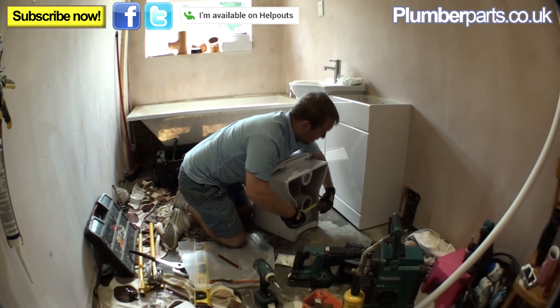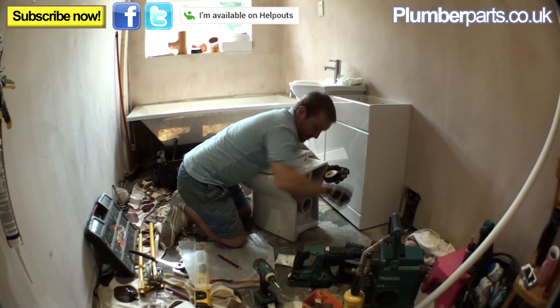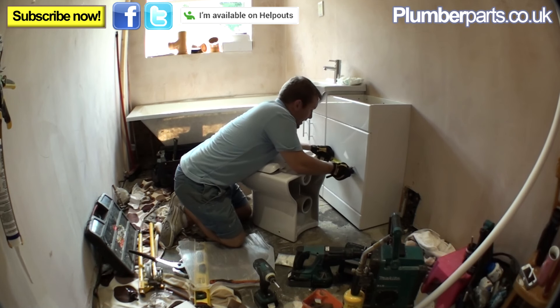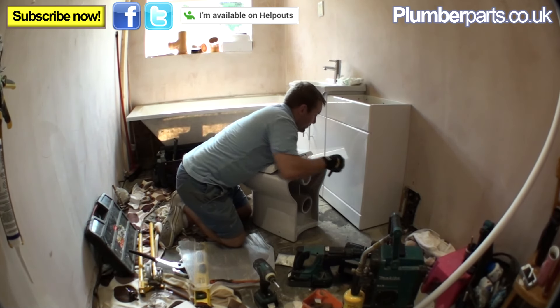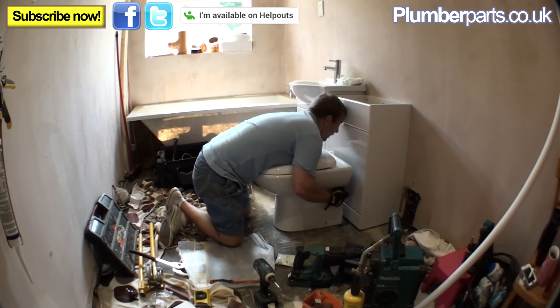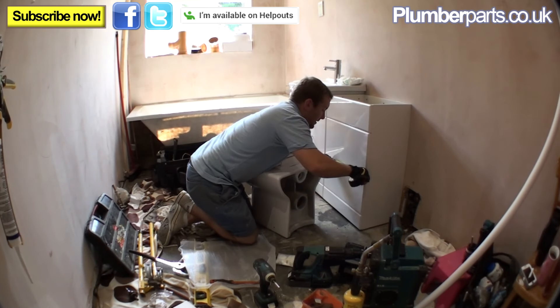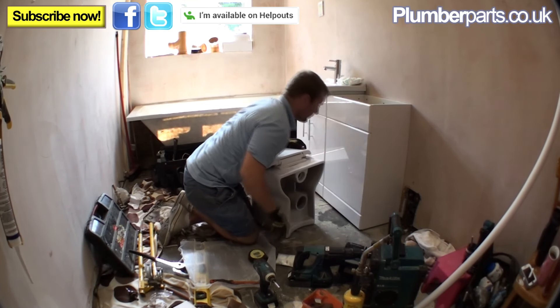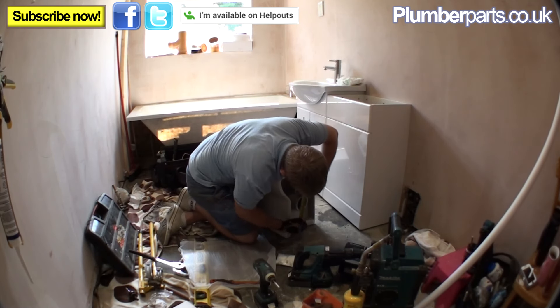180 divided by 2 is 90. So down there like so — I've got my centre line here, one mark there, the other mark there. So we've got our pencil marks on here now. I know that if I marry this up, we won't be able to see that — 220 is the narrowest point and that there is only 180, so we've got loads of room. The next thing you want to do is look at where the lowest point of the hole needs to be, so we're going to say 115.